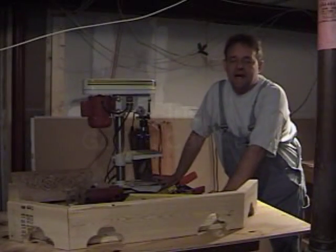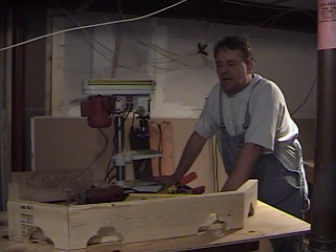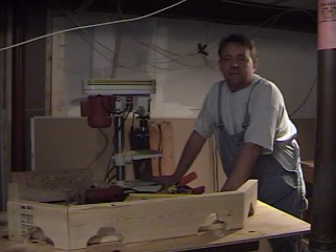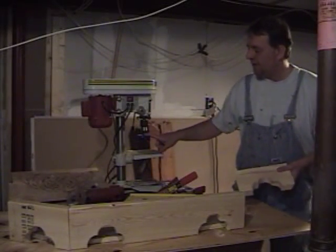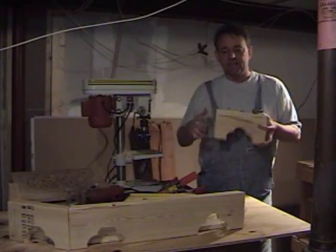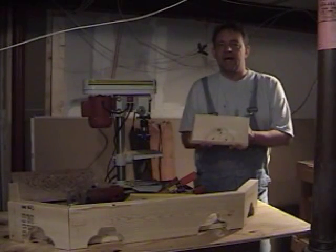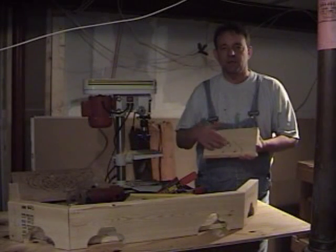I'm working on the base of the gothic cabinet - gothic, Celtic, whatever we're going to call it. I went to Menards and looked for standard pieces so I don't have to do a whole lot of milling. I use a two-by-six for the base, and since I have a two-and-a-quarter-inch drill bit I can go ahead and put this decorative detail on it. I've plotted out mathematically where the center is and send the drill bit down into it.